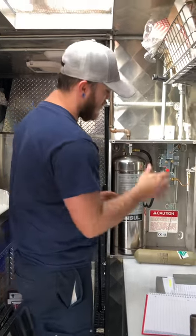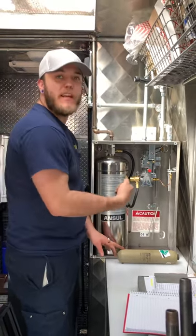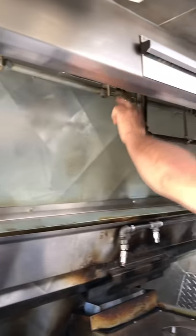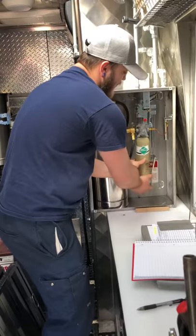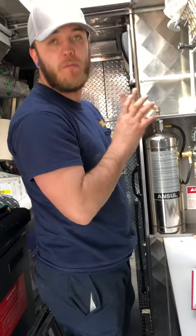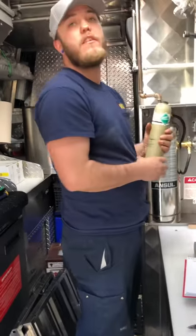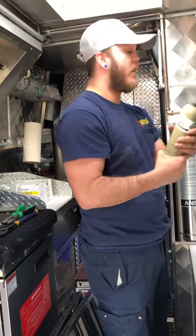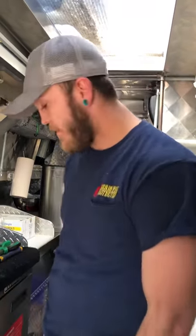After cleaning is finished and you're ready to rearm everything, take the lever and push it back down — you'll feel it lock with a nice tight lock. Make sure all your links are set and in the groove of each one of the link holders. Then proceed to put the cartridge back in and screw it back in, take your face plate, put it back on, and you're fully armed again. So in other words — if you're not cleaning, do not touch the lever. If you are moving, take the cartridge out, put the face plate on, and leave the cartridge safely inside.